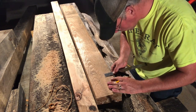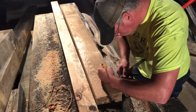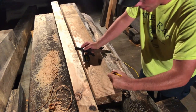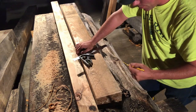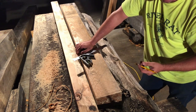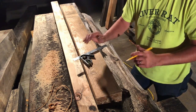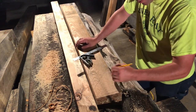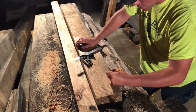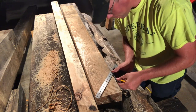And I know this, like I said, a lot of you guys had trouble understanding why I was doing that. Let me put it this way. How do I explain this? When you're laying out your braces into your tie beams and your wall posts, I'm setting them in 1/2 inch. So a lot of people keep saying, well, isn't that a 35.5 by 35.5 layout? No, it's still a 3-foot by 3-foot layout. You're just moving the whole thing into housings. But to make up for that angle that you need on those housings, you've got to measure up 3/8 of an inch for a 1/2 inch housing. By the time we put our 45 degree angle on that, it's going to turn out to be 1/2 inch long.